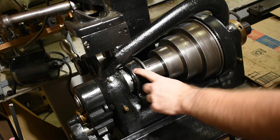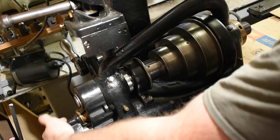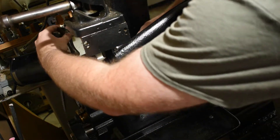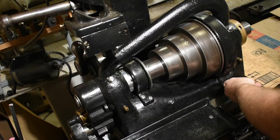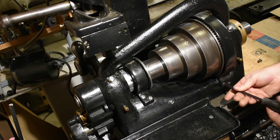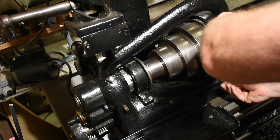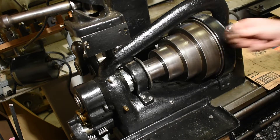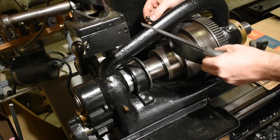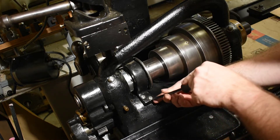The first thing we're going to do is remove the four guards. There's two screws in each — two here, two here, two on this side, one here and one here. I find it easier to get these guards out if the back gears are engaged. These screws that hold the guards on the cone head are different lengths, so you're going to want to keep track of them. If not, the guards won't go back on tight and in the right position. You can put them back into the holes where they came out of, or just tape them into the guards to make sure you don't get them mixed up.